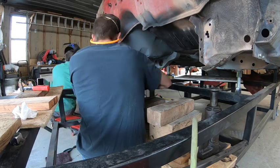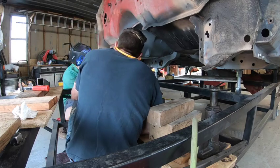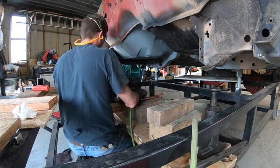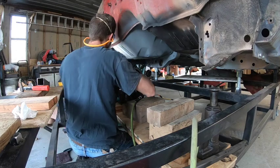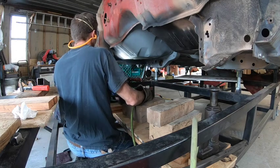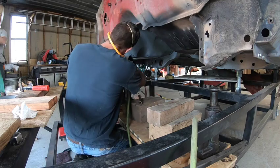My brother is under there welding up a couple of pinholes in a butt weld that I did on a patch. There's a little filler panel that goes from the inner rocker on the passenger side to the outer edge of that frame rail, and he's just finishing up a couple of pinhole weld-ups there. He's going to grind that smooth — it's easier to do without the frame rail in there.